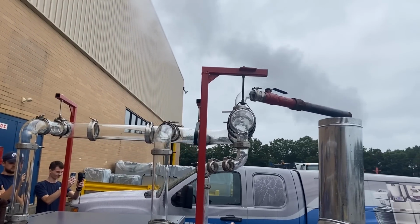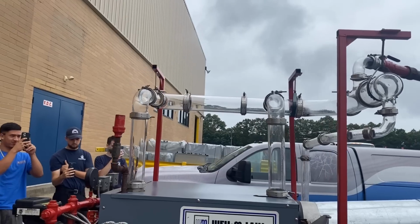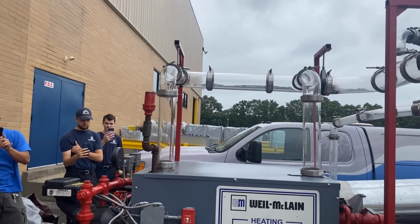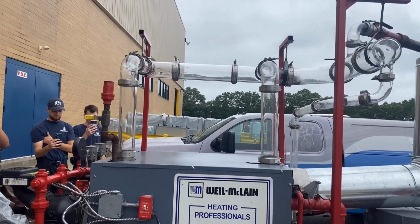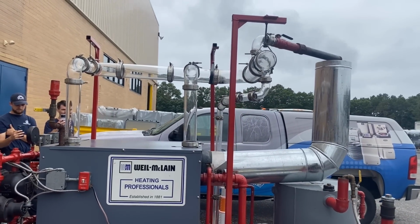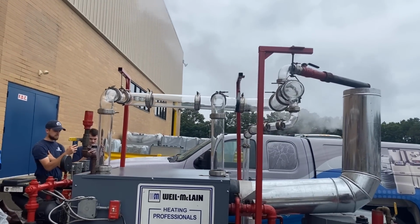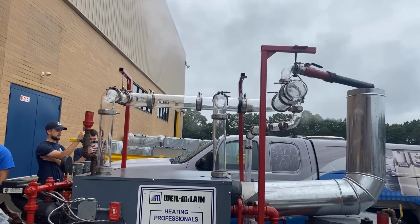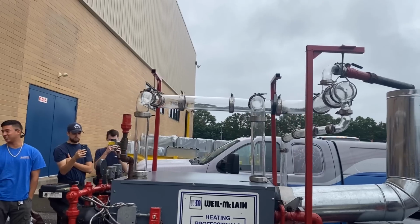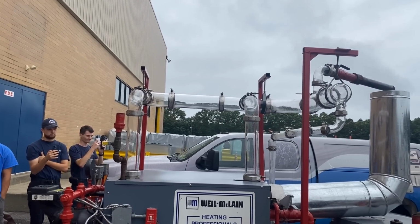As it continues, you're probably going to start seeing it come out of the boiler, start bubbling up. And again, that's what we want to see, 24 inches. You're going to start seeing it bubble out of the risers, trying to get up into the header. It might even get into the header, because I'm trying to simulate a building with a 2-inch piece of pipe and a pull down there. So it's kind of hard to do that. Imagine duplicating this. It's too expensive.